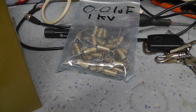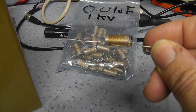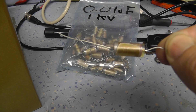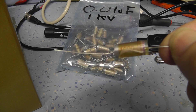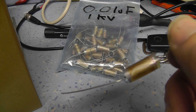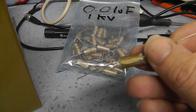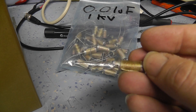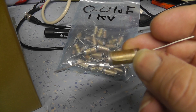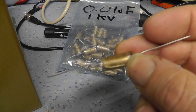Well that's alright — they've never been used, they're probably absolutely fine, I'm not worried about them at all. But I thought I'll just check to see if they're performing okay. So I put them on the LCR, the HP 4261. And sure enough, it says about 10 nF. Yeah, about 10 nF — that's fine. I was happy with that.